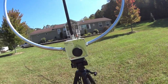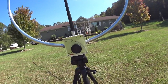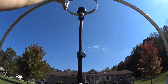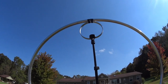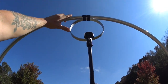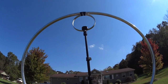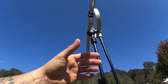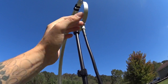It's small enough that you could put everything in a backpack. It actually came with a bag, though you can't really fit the elements in it — you can barely get the coax, the capacitor, and the uprights. There's the coupling loop right there — that's where all the magic happens. It does not touch the outer element. Looking at it, it looks like it might be off-center just a touch.